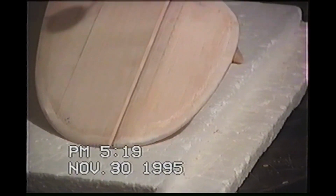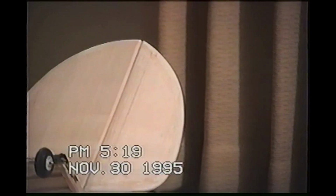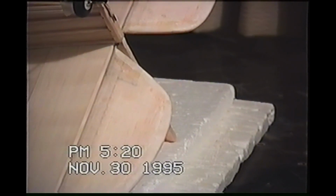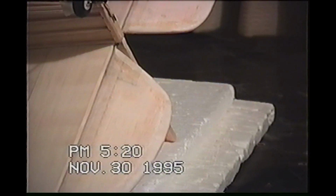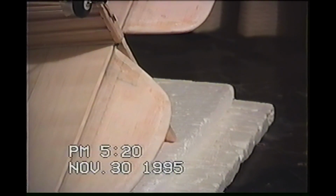The bottom side of the stabilizer, fairly nice and clean. The cut that I made on the fabric, because you see the overlap on the bottom side, all the overlap that you see is pretty fine. What I mean is I used the iron to kind of sink it into the trim glue, or the Stix-It that I put around to adhere to it, so it's actually stuck down to the fabric. You really can't feel it that much, and when you start doping it, all that'll kind of disappear. This one here is going to be pretty because now I know how to wet sand, or I think I understand how to wet sand, versus the Trainer 60, where I didn't do any wet sanding, even with the floats. I just sanded it pretty, and there you go.